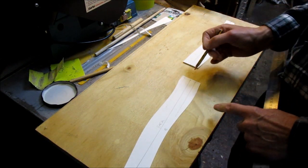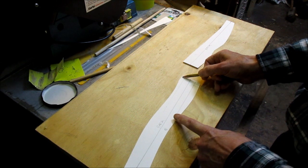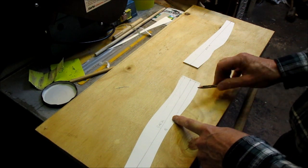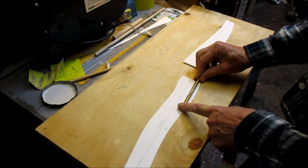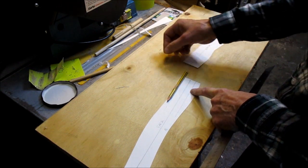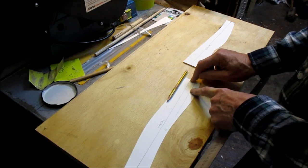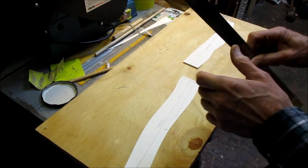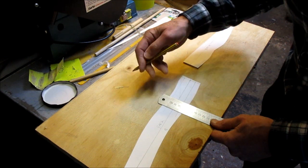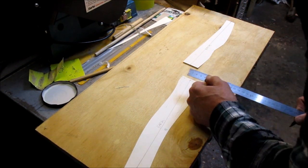This is what I was talking about before. If we do our Zed Splice in here, that doesn't look very symmetrical. I've probably mismeasured. If we did our Zed splice like that, using the full width of the bow, by the time we reduced the width, all of a sudden our Z would be very much shorter. Do you see what I mean? We've cut down that line and this line to be half the length they were before. And it's the length of the lines that's important. You want a decent glue line. It's the length of glue line that matters. Where have I gone wrong? Yeah, I've measured. That's 15. That's funny. Optical illusion. I'm not that far out with my measurement.